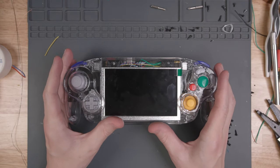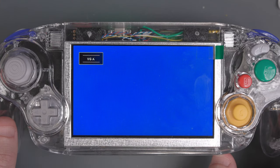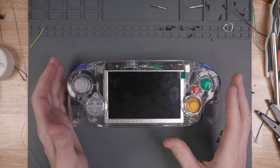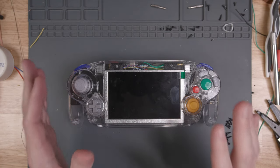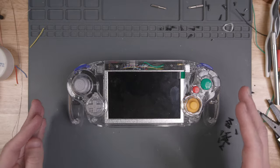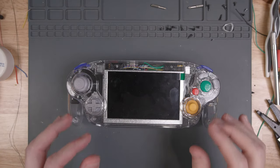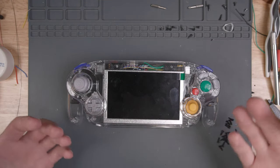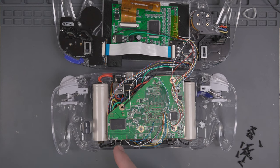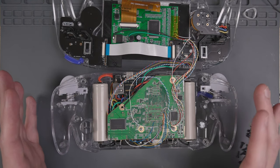I've been testing the Ashida for a few days and for the most part there aren't really any issues. However, sometimes when I try to boot the Ashida, RV Loader doesn't seem to boot — it goes to a black screen almost like the console is not booting. I've been asking questions in both the BitBuilt Discord and I reached out to Gunner, also known as Gmanmod, who builds and sells Ashidas and portable Wiis on Etsy. Because of the way I soldered my Ashida — with wires coming from the front of the trimmed Wii board — it makes it really difficult to troubleshoot.